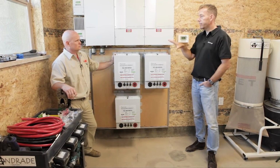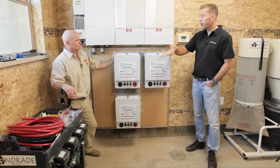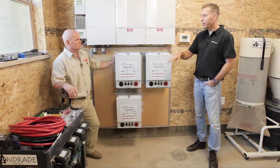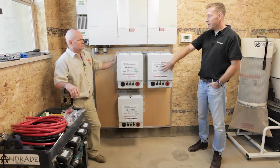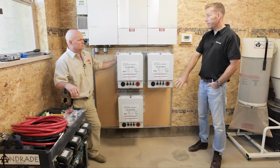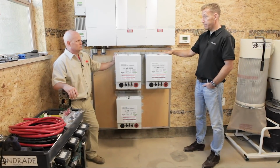But it replaces and supplants all the information that you'd typically get from their external battery monitor that's designed to do some of the fancy data logging and the like that we have built into the BMS of this product for lead acid batteries. Right, so it's just going to replace that set of parameters and appear as that device on the network.